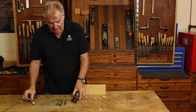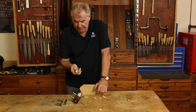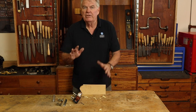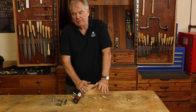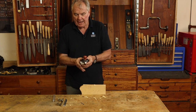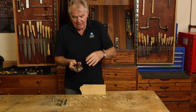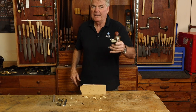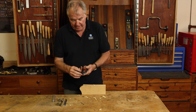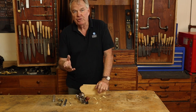There's also a fence that screws on as an extra which is 20 degrees. This fence cocks the plane at 20 degrees so you can make raised panels easily on a cupboard door or wherever. With this fence fitting on the right-hand side, if the timber grain is running one way you can plane that way, then move the fence to the other side to plane the other direction while still planing with the grain. Some planes only have a fence that fits one side, but with this tool having the fence fitting either side, you avoid needing two planes to do one job.